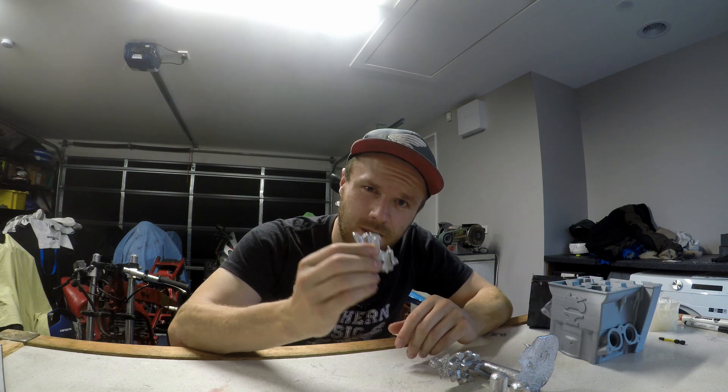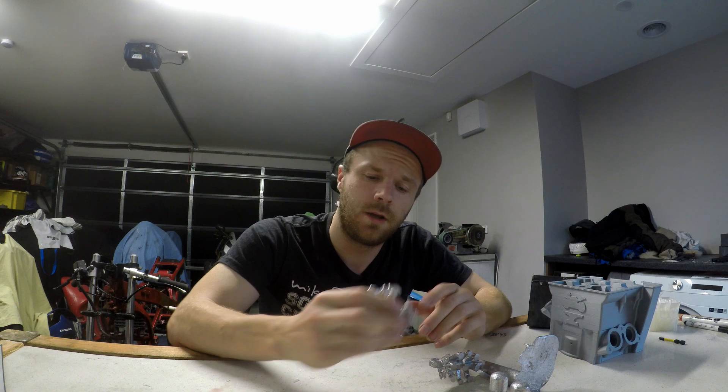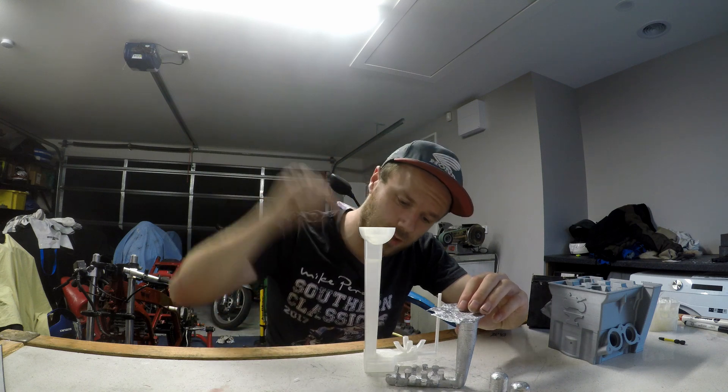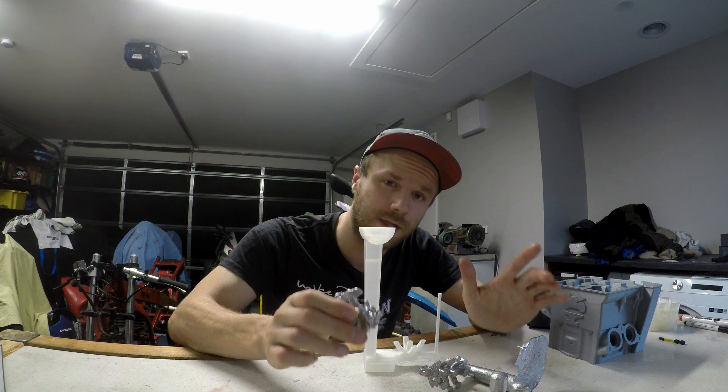Logan here from the Motorcycle Forge and today we are back on trying to cast a cylinder head in our garage. In the last video we got to do some casting and as you can see the molds didn't come out exactly as we hoped they would, but we did learn a hell of a lot from them. So for the next attempt, the sprue is more than double the size, which should have a lot more pressure to hopefully fill up the casting more completely.